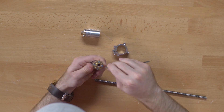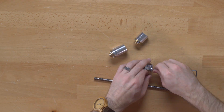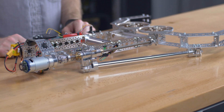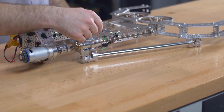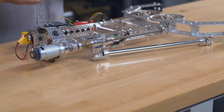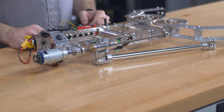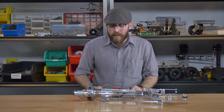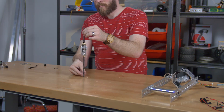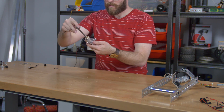The trick to making a dual lead screw nut setup work is having them clamped together. These two clamping hubs are clamping onto these hub spacers, and that's the key — because I can loosen this one here and rotate it just a little bit one way or the other, which will move it a little bit further or closer to the other one, to get the spacing just right. I do that before this is all attached to anything else, and then you do the gravity test where you pick it up, let go, and see if gravity alone will pull the assembly along the lead screw.